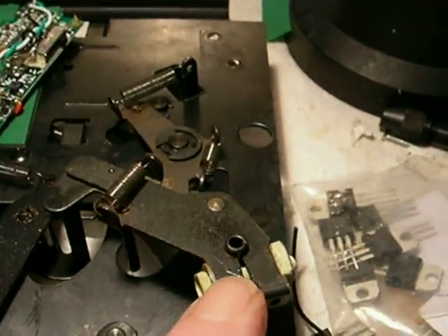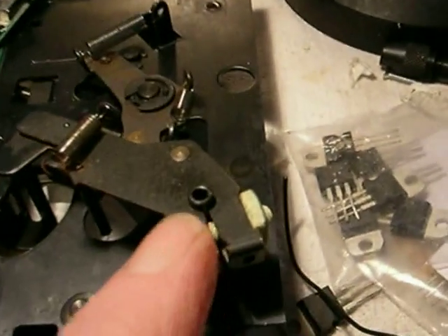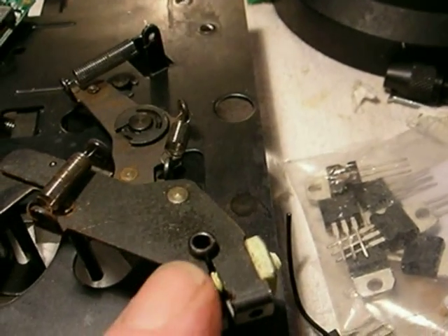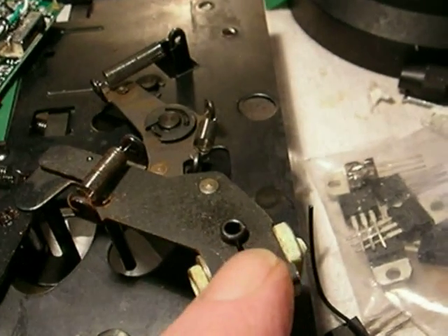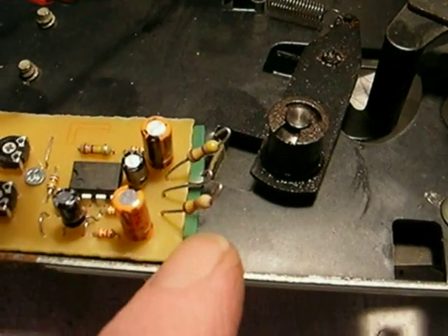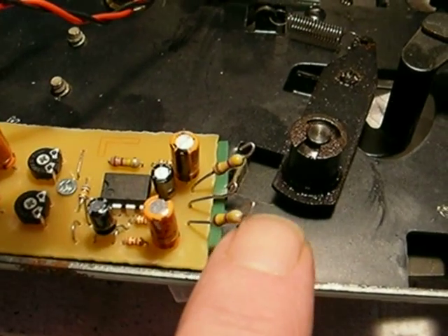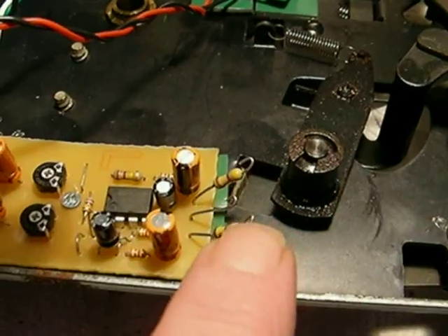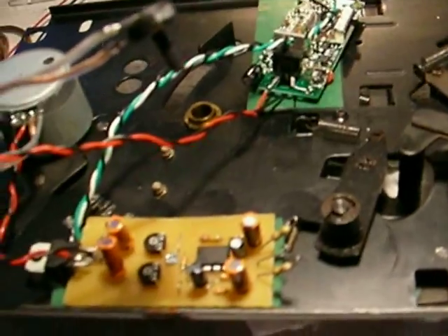Your tonearm wires — you wire it for stereo. All of these have a three-wire cable: black, white, and red. You'll use the black for ground and then red and white for the left and right output of the cartridge, coming out of this hole. The signal wires — the red and white — will go to this resistor and that resistor at the little hook there. The black ground wire will go to this little hook right there, and that hooks the arm up to the system.